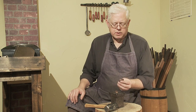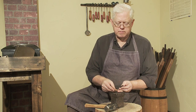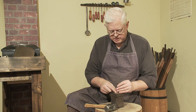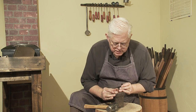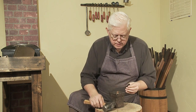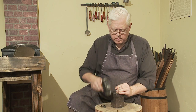This is the exciting moment. We're going to take this finished punch — it's been tempered — and we're going to drive it into a piece of copper. In this case, it's been marked as to the position where the letter should be, and we'll position it very meticulously. Hope it's upright. I'll give it a light tap and look to see if it looks straight. Now it's a little off — I'm going to twist it just slightly. Okay, that looks pretty good. I just feel that it's back in the same place where it was. Then I whomp it in.